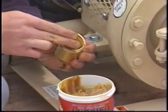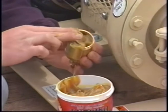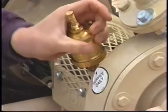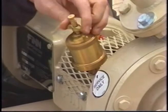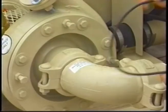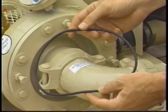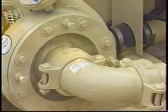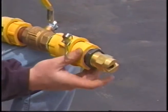Leaks at the pump shaft are usually caused by the automatic lubricator not being serviced or the wrong kind of grease being used. Replace the pump seal and service the pressure lubricator daily using a soda-based grease. On occasion you may have to service a bad cover O-ring gasket. If so, replace and use plenty of grease when reassembling. When a leak occurs at the cam lock fitting, it may not have a gasket — simply replace to use.